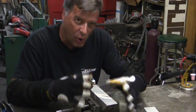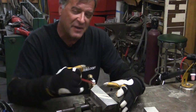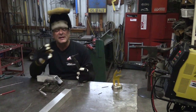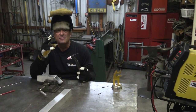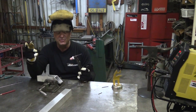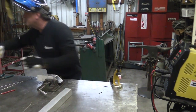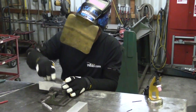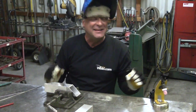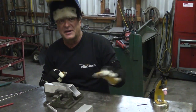I'm going to pull this piece out, douse it off in the sink, and get it cold again so I can start with a cold piece. I'll turn the amperage down and run another bead on a different side so we can compare the two. Here's a brand new E3 tungsten, freshly ground, never been used. New side of the aluminum, all nice and clean and shiny. 75 amps on the machine — let's try it.